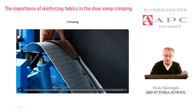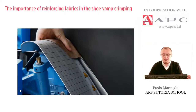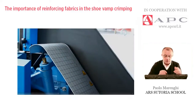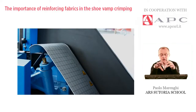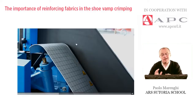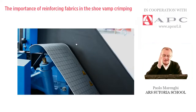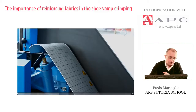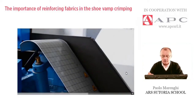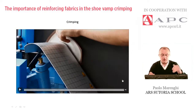The crimping operation is very slow. The operator presses the pedal step by step and pulls the sides of the machine. The mold pushes the piece. This machine is made of three plates: the two side plates are a little colder and pull the piece to be crimped, while the black mold, which gives the curve, is hotter and pushes the piece into the opening. After a few seconds — the timing depends on the material — the machine opens and the piece is perfectly shaped and molded.